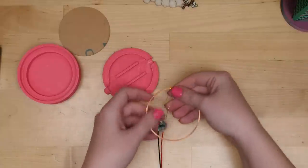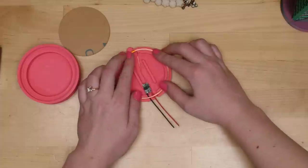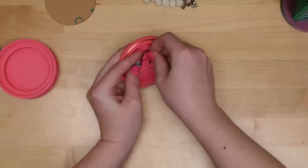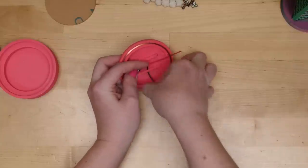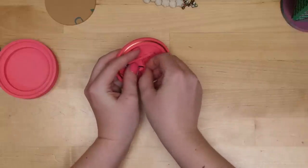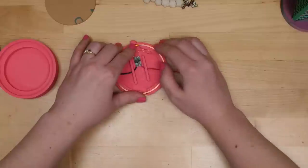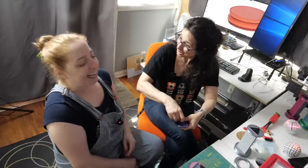After the mirrors are in place, the next step is to put the electronics in place, then put the compartment with the LEDs and electronics together. It's probably easiest to attach the electronics to the base first before attaching the base to the kaleidoscope. If you just make a loop through one of these holes, you're going to get a little bit of strain relief — if somebody pulls on the wire, you're not going to break the components inside. Wearables teach you a lot about strain relief.